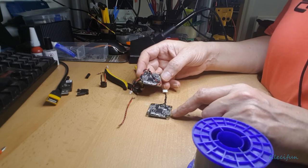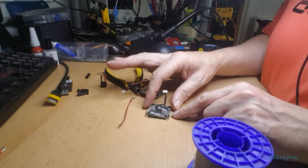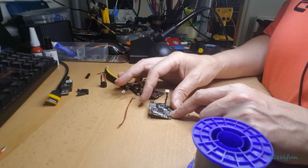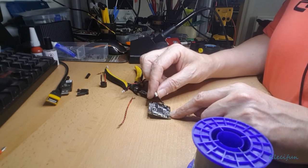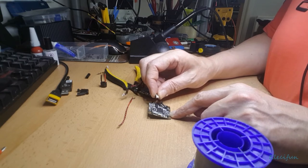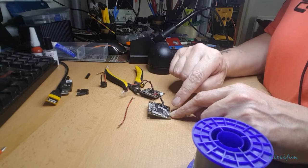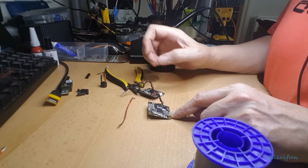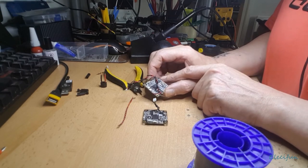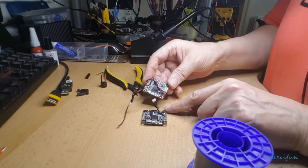Oh, I suppose there's one there, look. Yep, there's one there. So we can just use a 5 volt from here. So what I'm going to do is move from the receiver. Our receiver goes underneath here and it just about fits into that, which is perfect. If anything, I may shift the receiver wires over here to TX1 because I'm not really using that. And then keep the 5 volts there for that. So that does the receiver.